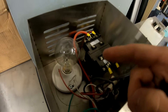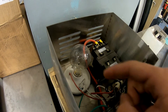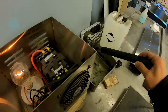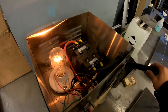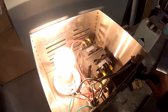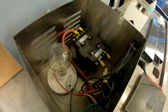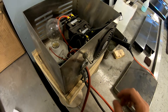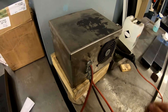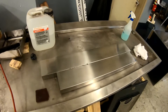This light bulb is 150 watts, and the reason I have it there is that the resistance of the light bulb will only let 150 watts through the transformer. As you start putting load on this, you'll notice the light bulb varies in intensity as more and more load is put on the machine — so it's essentially acting as a current limiting device, and that keeps the transformer from blowing up. The fan is just wired across the switch and neutral, so the fan is not part of the current limiting — it gets the full potential. That's what's inside the box.